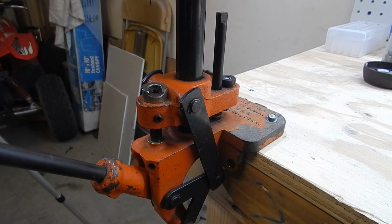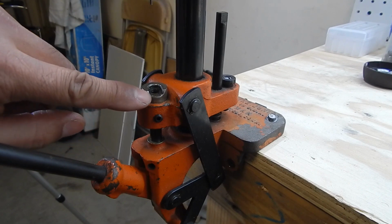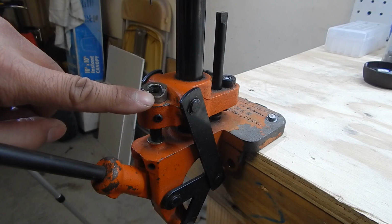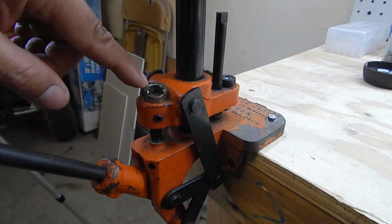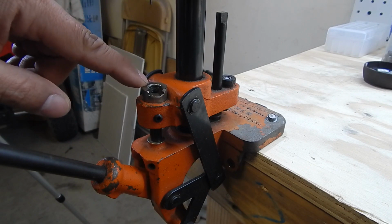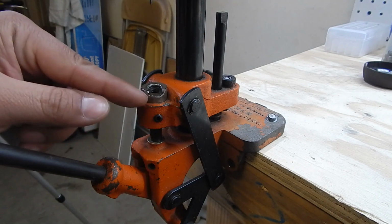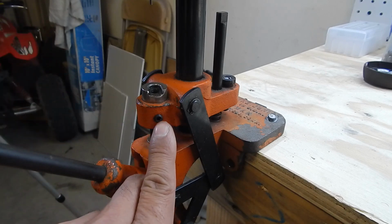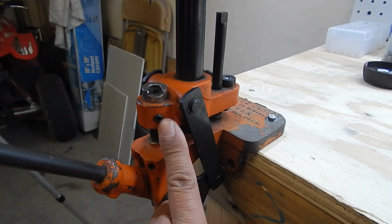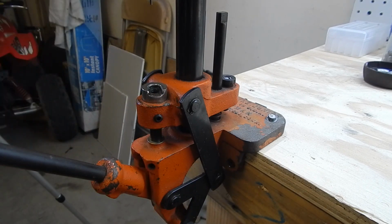so let's take a look at the bottom portion of this press. Right here you can see the shell holder, which is called a J-type shell holder. In this case I'm going to be reloading 357s. So 357s and 38 special actually take the number 1 J-type holder, which is always stamped on the top up here. These are interchangeable depending on what caliber you want to reload. You can take off this little hex screw with the Allen key, and these just pop right off and you can put a different one in there.